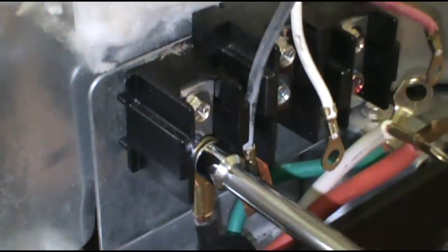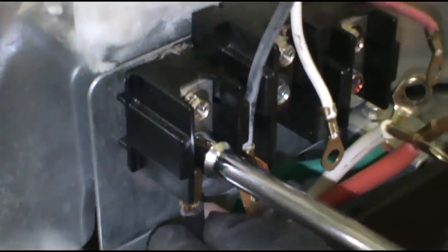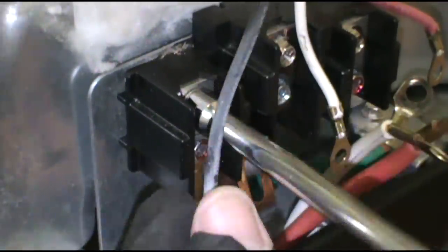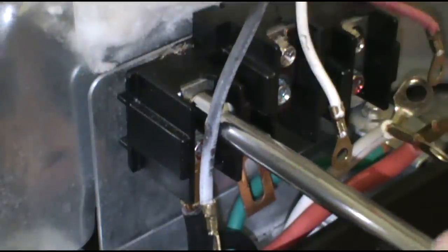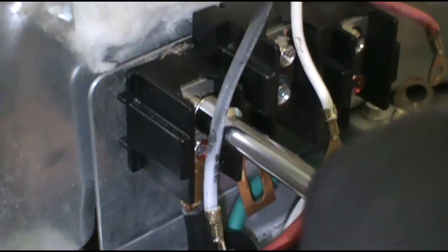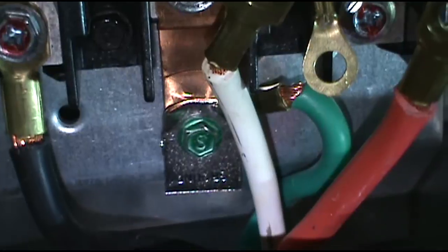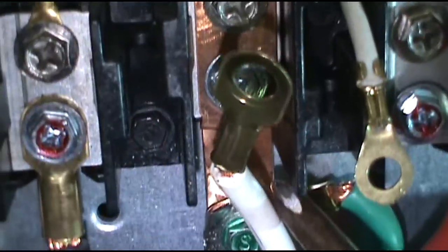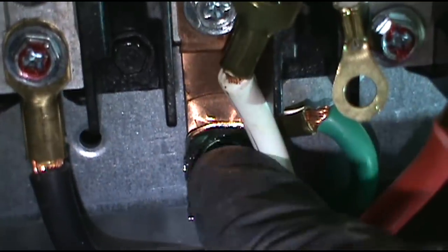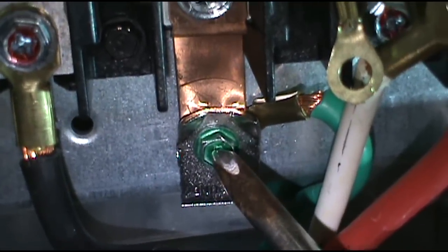Especially since the black wire was all charred up and I had to run a new one. Black, white, and red all the way down — black, white, red. I won't film this whole process, try to keep these videos as short as I can. Quick little tip: before you put the white wire on in the middle, do the ground wire first. Because once you put the white wire on, it's going to be hard to get back here to put the ground wire on. So put that on first before you do the white.